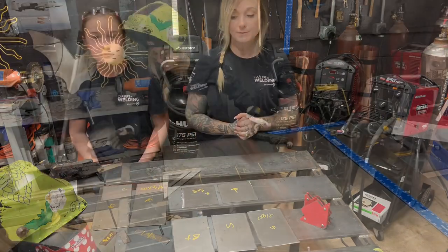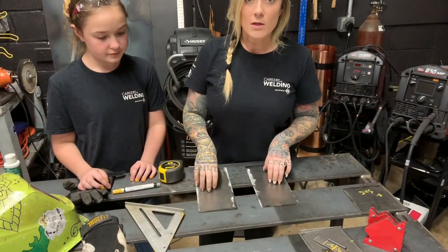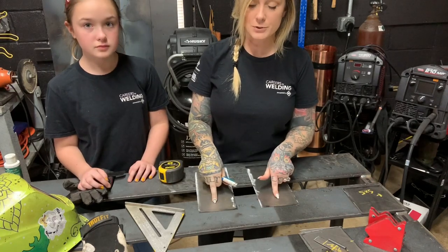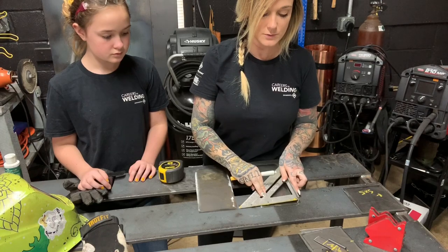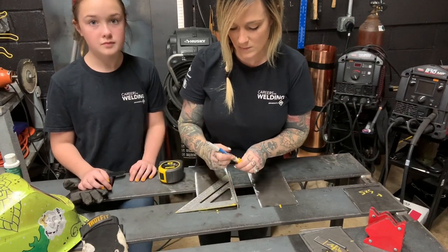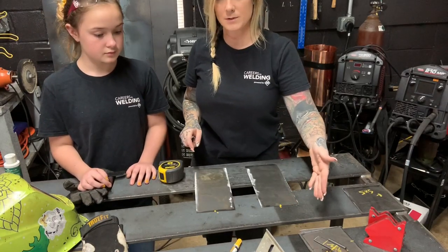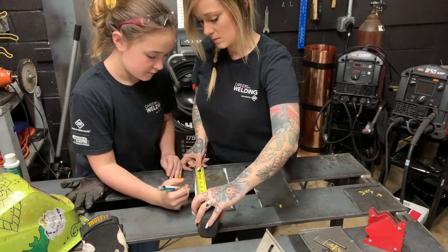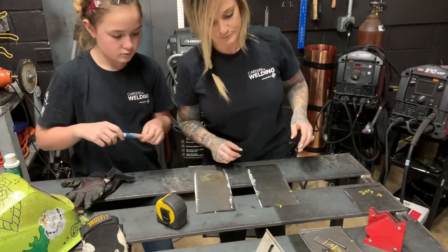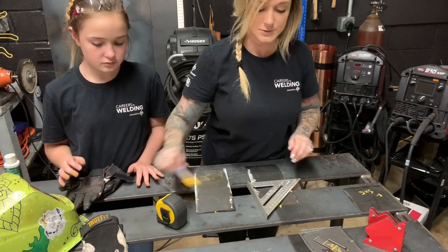For the perch you can use a piece of quarter inch round rod — we have about a two inch piece cut, but you can also use a nail, screw, or anything you've got laying around. Now that we have all our pieces cut, we need to cut the angles in the front and back pieces. We need to find center on the top portions of these two pieces — they're four and a half inches wide, so two and a quarter inches is our center mark. Then from the bottom of each side we come up seven inches, since our side panels are cut seven inches high. We run a straight edge from edge to edge to get the pitch for our roof.